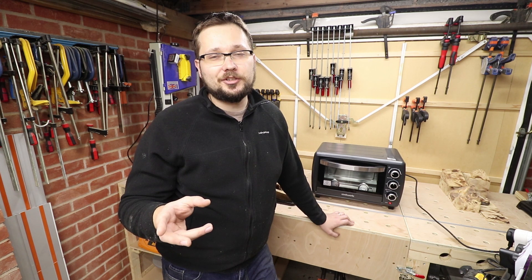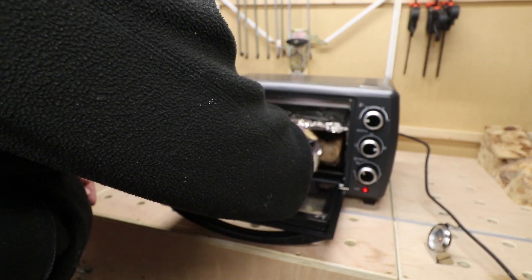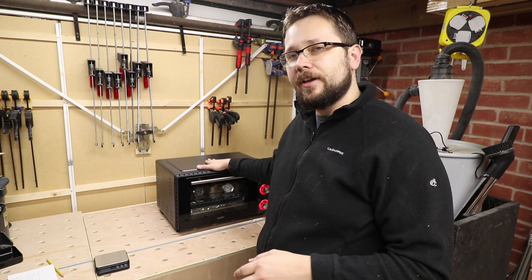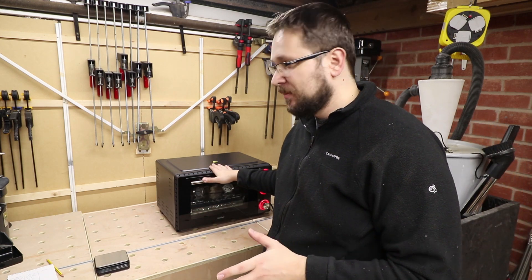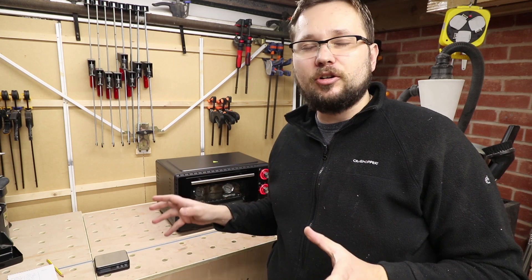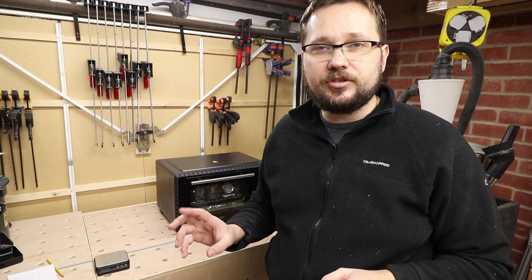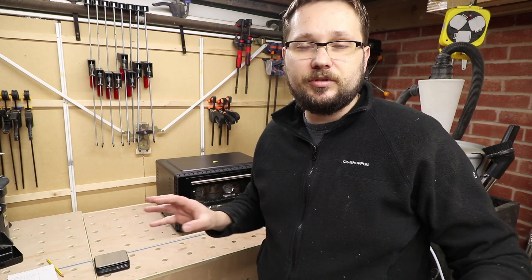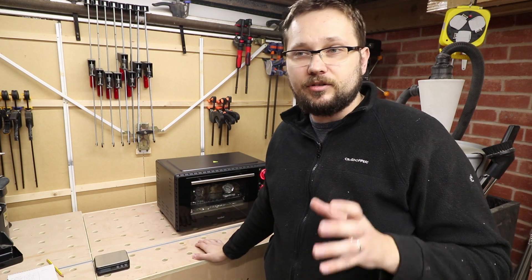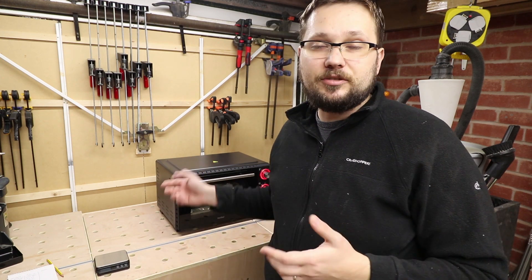For you it will be a second; for me, at least two days — catch you in a bit. So we're about 20 hours into the drying process with my oven, and as you can see it's a different oven. After about six hours when I left it overnight and came in the morning at about five, the old oven had reached about 150 degrees Celsius. The thermostat went on it and regardless of what temperature I was setting, 150 was the absolute minimum it didn't want to go below. That temperature is way too high, so on some of the pieces I do have small cracks because obviously the moisture escaped too rapidly. That's fine — I can deal with that, they are going to be cast in resin anyway, so that's probably going to add some cool features.